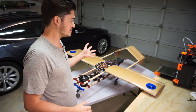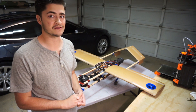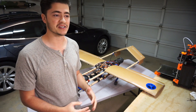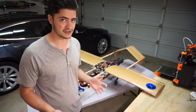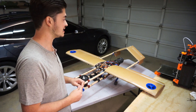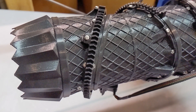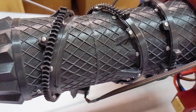What that means is, since the 3BSM can flex a little bit under load — it's just thin plastic structures after all — that flex can be enough, if the gears are really fine, to cause the gears to skip. I found that in testing, especially when thrust is being produced and I'm trying to transition the nozzle back from forward flight to vertical flight. The sections can kind of skip and slide around, which probably wouldn't produce a very good result if that happened in the air. So the new gears are something like 20 pitch relative to the 32 pitch of the brass gears — quite a bit coarser, a lot more contact area, and way less likely to skip when the duct deforms.